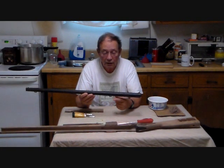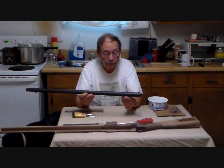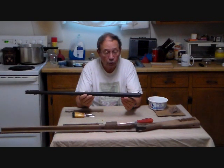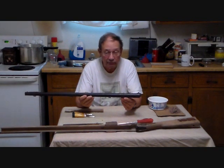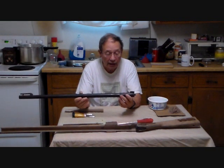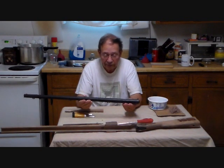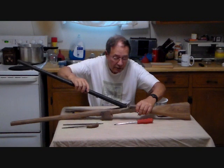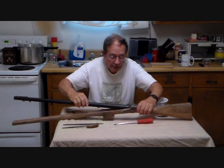Secondly, the lugs underneath the barrel are not quite plumb with the barrel. The sights were set considerably off-center — they were sloped off to the side of the barrel and out on the top. So I'm going ahead and removing the rear sight, as you can see here. Now, when I hooked it in the breech, it would stand up at quite an angle.